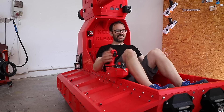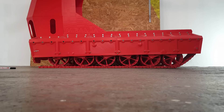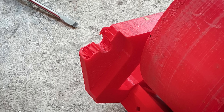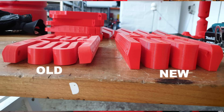But the tank is getting old — it's almost 3 years old. After the last drifting tests in the shop I noticed that the tank was way lower in the back than usual. After taking a look I noticed that the rear suspension sets were broken, so I designed a beefier version of them and printed them in my big printer, which has a 1.2mm nozzle and makes super strong prints.